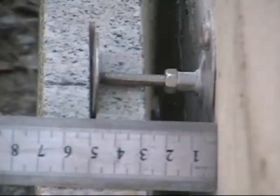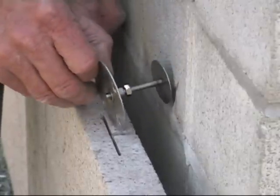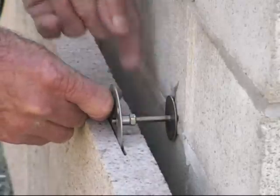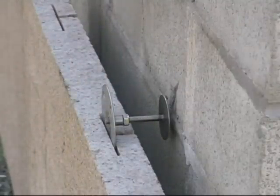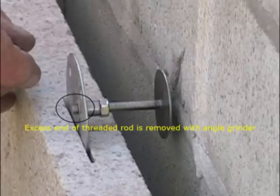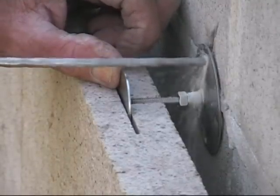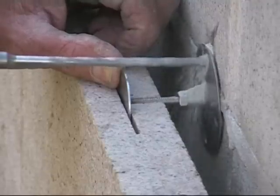When using stone clip, the curved fixing point in the stone panels allows for a softer joint and is not as prone to breakage as with pin-loading systems. If a panel is bumped or jarred, it has less chance of breaking from the panel with the disc as opposed to the pin, which allows very little movement. If a panel is installed correctly there is no load in the turning point from top to rear of the panel, hence it is centered on the front disc.